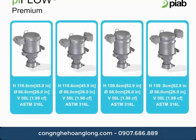This is our last piFLOW P model, the 56-liter unit. This is our largest vacuum receiver. It has more filter surface, more volume, and more flow capabilities than any of the previous conveyors we mentioned earlier. This unit is typically reserved for the very high-end transfer rates. Fluidization is also an option on this unit for the non-free-flowing products.